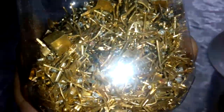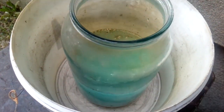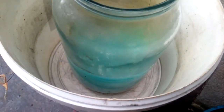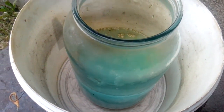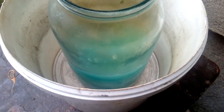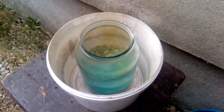This time we don't use electrolyze because it's very good quality pins. Now we go straight to nitric acid. We start with one third of that pins, drop in the jar and put 30% nitric and 70% water. Now we leave it to let the nitric acid dissolve any base metal, mostly copper.